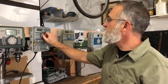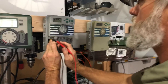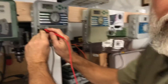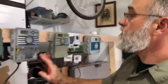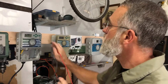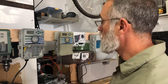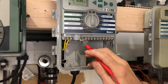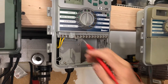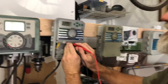This controller is going to be a little bit of a different scenario. Whereas before I didn't have a place to put my probes, on this one I can check it. I know my source is good — we checked that earlier. When I look at my multimeter, we have 27 volts, so I know my controller has already transferred that 120 volts into 24 volts, which is appropriate. Now I'm going to turn on zone one. Zone one is on. It has a metal jumper right here completing the circuit, so I know I don't have to worry about that. I put one probe on the common and one probe on the master valve, and when I look over, I have no voltage.